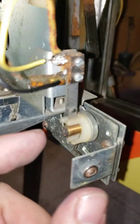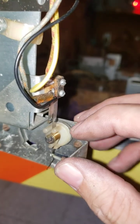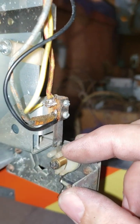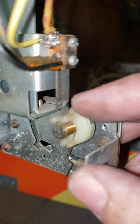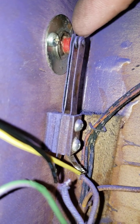One of the issues these coin doors have is this weird little mechanism — if you press it, these connections move back a little bit. If you press this it'll simulate a coin drop, which is kind of cool, but it's also directly wired to the start button. We didn't know why it was like that until we started messing around with it. This is also wired to give a coin drop, and that was the only thing we were worried about since we had no start. So what we did is we re-soldered these wires and centered them up to connect to this button here. This contact wasn't making good connection — these contacts had to be bent forward a little bit so we can make contact when we press the button.